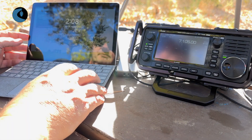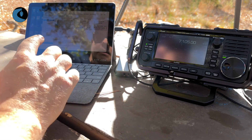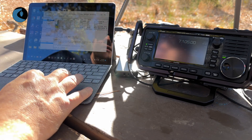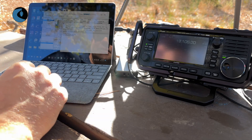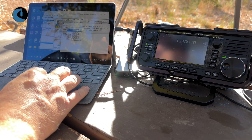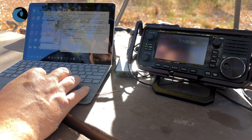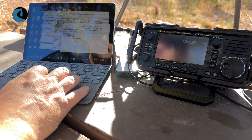Now I'm going to open up Winlink on the Surface. I've got my Winlink set up here and I'm already set up on VARA HF because I was doing some testing earlier this morning to make sure everything was configured. I'll hit the open session option and check if we can get a station. We'll try and connect up to — let's click the drop-down menu — we've got AJ7C. We've got his gateway already saved, so we'll select AJ7C. That's for 80 meters — it should select his 40 meters. There's 40 meters, and it jumped to the correct frequency.